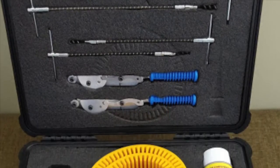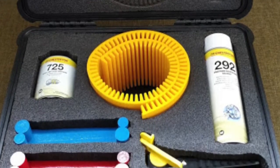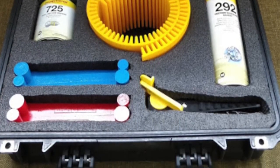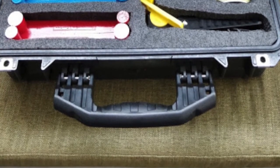This is where a tamping tool is used to make sure the packing is pushed into place. Without a tamping tool, rings will bunch up and cause serious performance issues, and the packing will shift in the stuffing box.